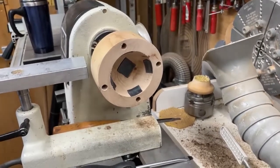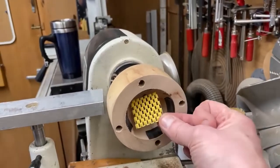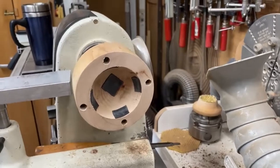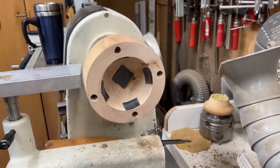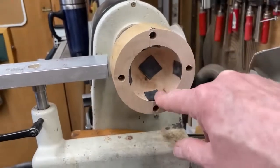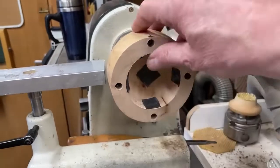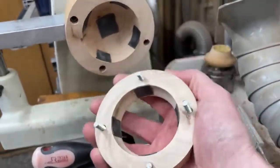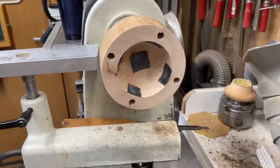This video is a follow-up to the last one. What I found with the little bit of router mat put in the bottom is that it wasn't holding it tight enough because it was literally at the bottom and not evenly spaced. So what I've ended up doing is sticking some small bits - neoprene or rubber from an old inner tube - super glued on the inside, and the same on the inside of the lid. Because it's all evenly spaced now it grips the ball much better.